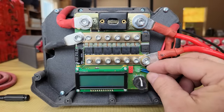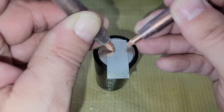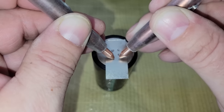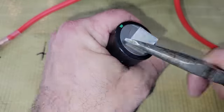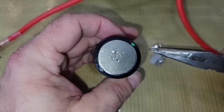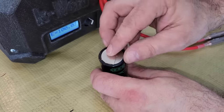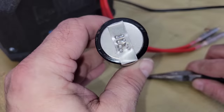In automatic mode, the welder emits a quiet beep while it's on, and when both electrodes are touching the strip there will be a short delay with a louder, rising tone until the weld pulse. Keeping the electrodes on the strip will cause the display to cycle through information about the weld it just performed. After switching to automatic mode and turning the joules up to 100, I tried another nickel plated steel strip which welded much better than the previous one. Then I tried a pure nickel strip, and the welds looked really good on the surface, but the pull test showed the welds weren't as strong as they should be.